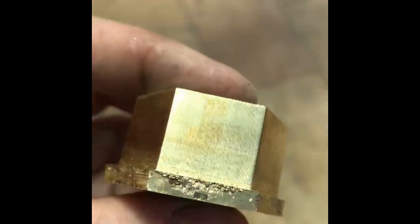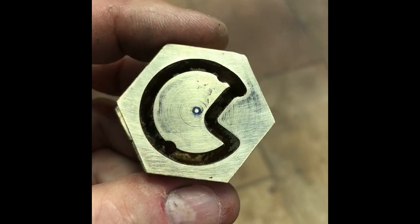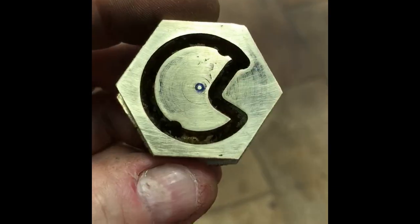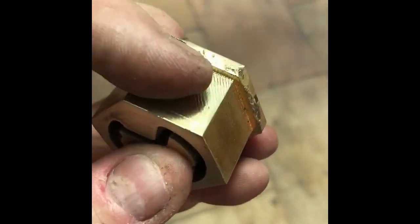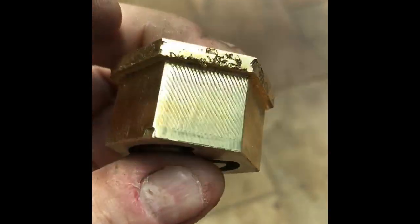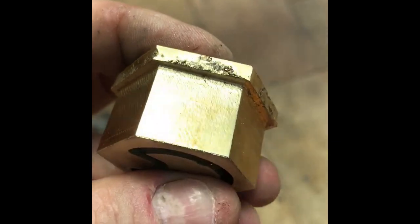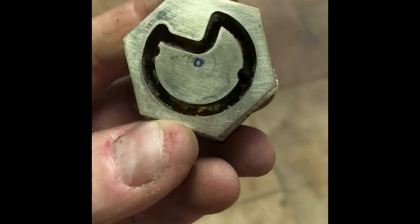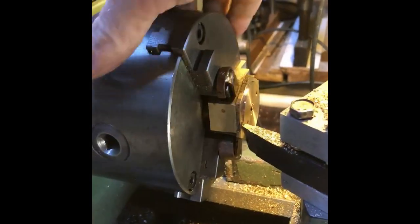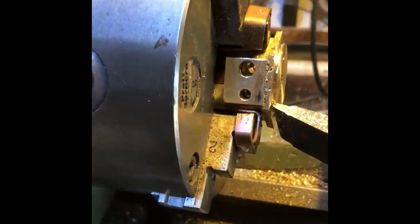The center of the casting seems pretty solid brass, and it's all gone really well. The trouble is the more time I put into this, the more nervous I am about making a mistake. With the machining, I left 0.3 of a millimetre — there's some chatter on some of the faces — I left 0.3mm just for final finishing down to size, which I'm glad I did.